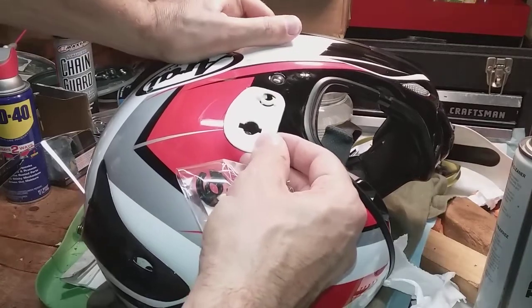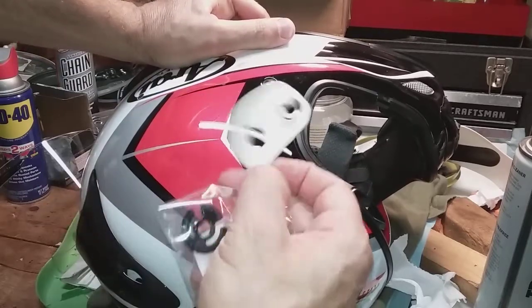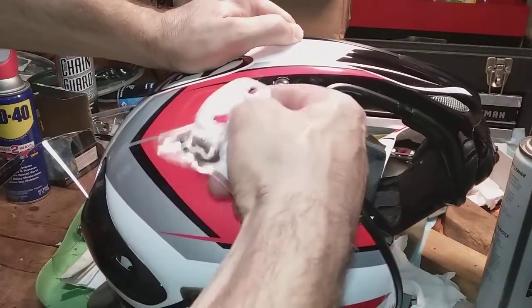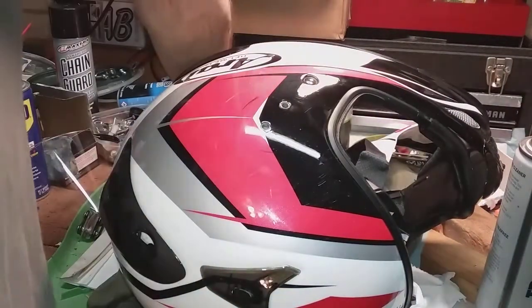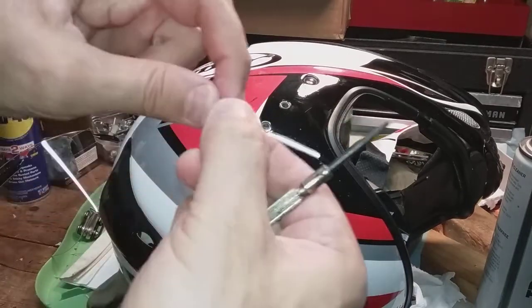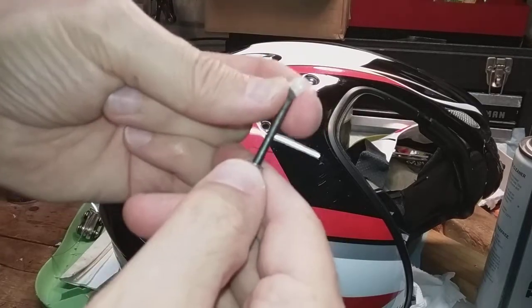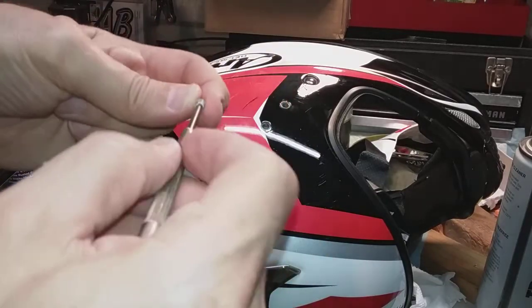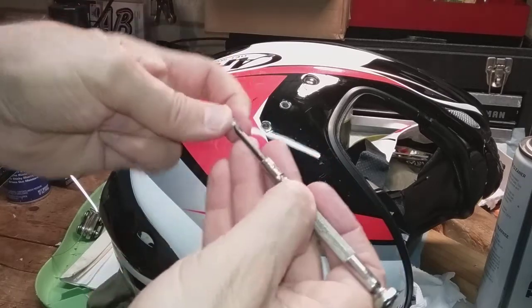To install the plate, they say they have a jig, but really you just have to line up the holes — it's not rocket science. I traced it, but wound up cleaning it off with alcohol to get the glue off. To get the broken screws out, I heated up my screwdriver with a torch. The broken-off nubs were inside the hole where the screws had sheared. I stuck the heated screwdriver into the plastic, let it cool a little, hit it with a little WD-40 first so they wouldn't stick, and backed them right out.